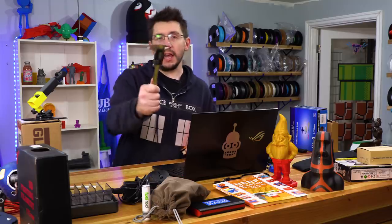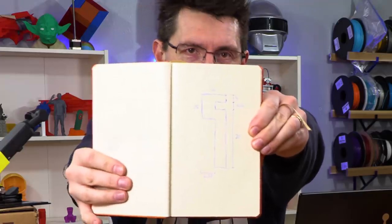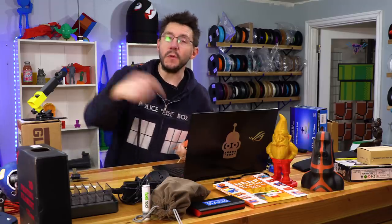In an effort to speed things up, I'm not gonna bore you with the measuring stuff. Essentially, you take calipers and you measure things, and then you write down the numbers on a piece of paper — much like that. So here is what we're gonna do: we're gonna take this drawing right here and go into SolidWorks X-Design, recreate it, export an STL file, then print it, and find out if 3D printing can solve this problem.